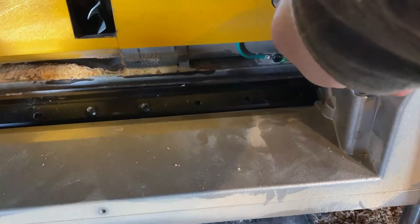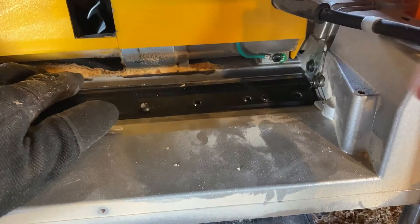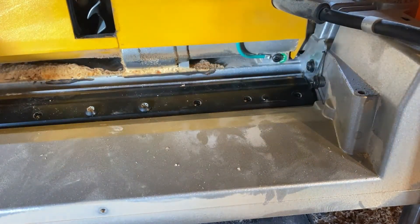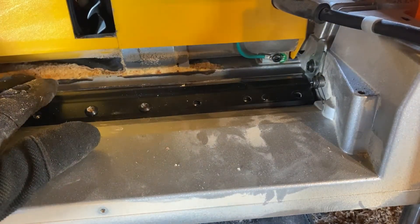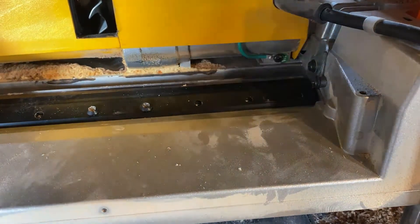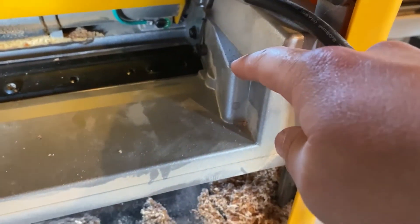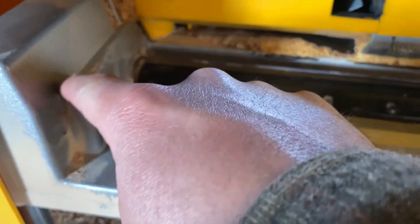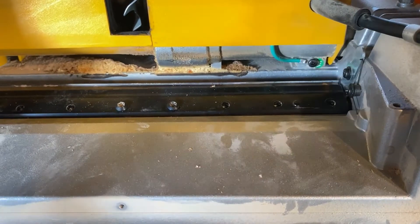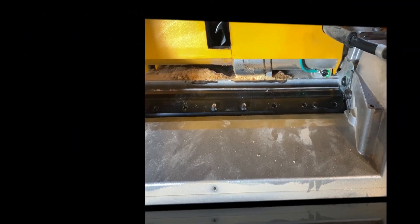You release this lever here, which lets you spin the cutterhead, and it'll click into place — locking in for the next blade. You do the same exact thing on the next one and again on the third. Then replace your cover, put the screws back into these two holes, and you should be ready to go. Thanks for watching!